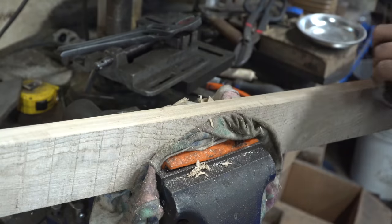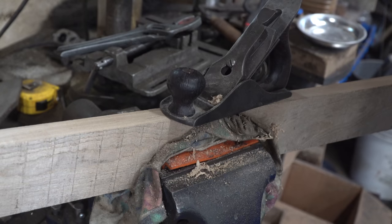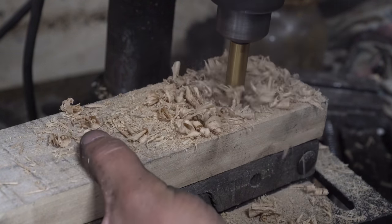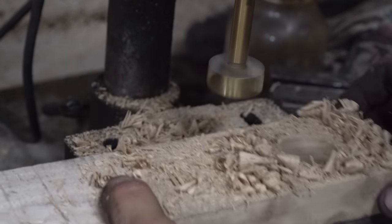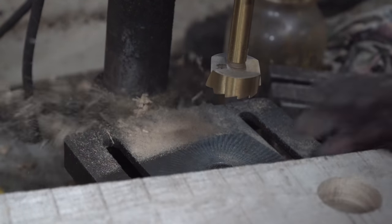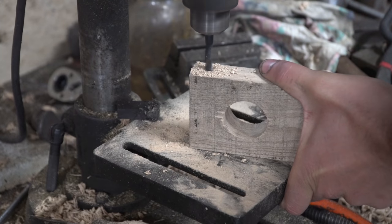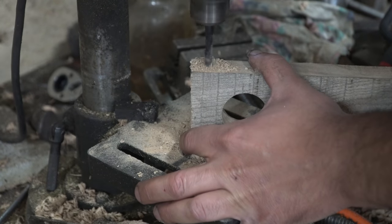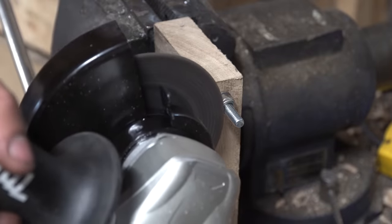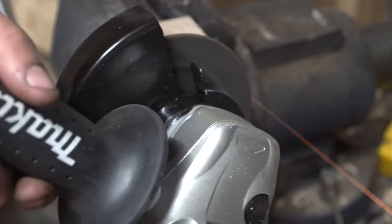Now we're on to making the connecting piece for the saw arm that kind of mimics human beings sawing. I get to use my nice Stanley number two hand plane for this — whenever I can whip out a hand plane, I'm going to, because I absolutely love it. I'm just trying to match the original as close as possible. All big shafts on this are an inch and one-sixteenth in diameter, so that's what I have here with this Forstner bit. But it's not just about drilling two holes for the shafts — there are also locking bolts at the end to stop the ends from splitting. Both ends need to be drilled, threaded, and locked in place.